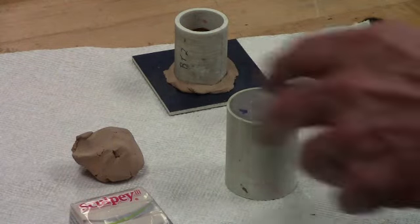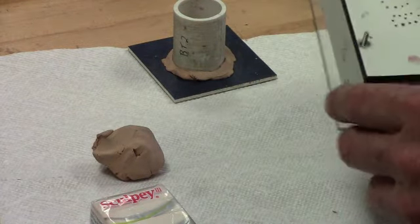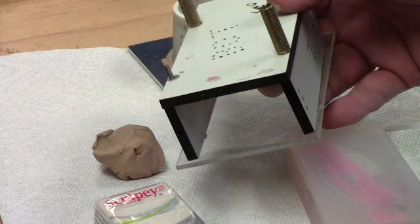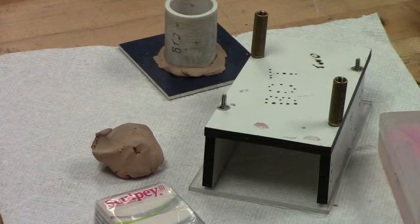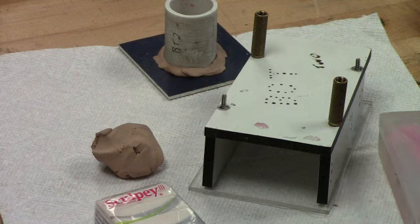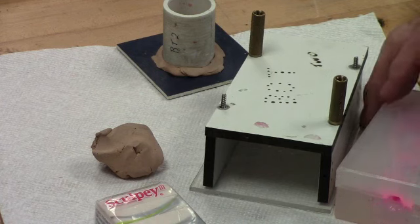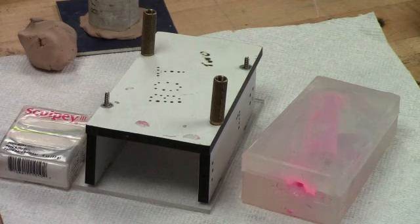I've also, over the years, for bigger parts where it's not practical to have a tube, made boxes. And the boxes that I've made here have a taper. There's a taper on the top and a taper on the bottom. The advantage of doing a box like this is you can pre-establish your parting lines with clay and pour one half of the rubber or the molded material and get half of your pour. And then you remove the clay and put a mold release on and pour the second part, and you'll end up with a mold where the parting lines have already been established in your two-part mold,